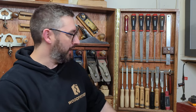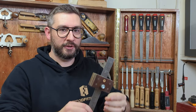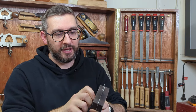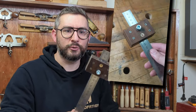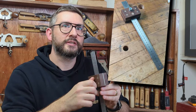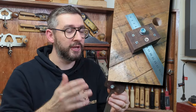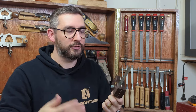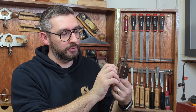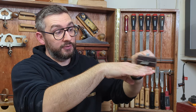This side of the tool cabinet is for chisels, knives and rasps, and also this little ruler gauge. I made it a few years ago from Brazilian walnut and aluminium — epoxied through. It's a really handy tool. You want to leave a mark exactly eight millimetres from an edge: slide it down, tighten it up, and you've got all this to use as a fence to make your marks. Comes in handy all the time. I've been meaning to make another one for a thinner ruler as well.